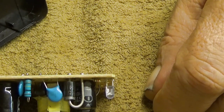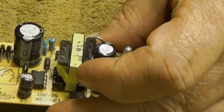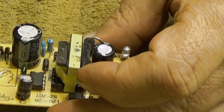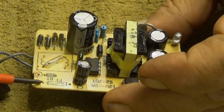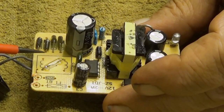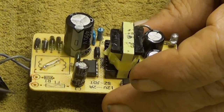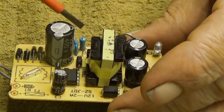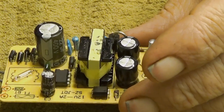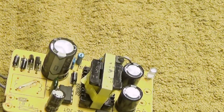That's it. So, what are we missing here? First of all, the inrush current limitation. Nothing there. Then we are missing filtering for outgoing towards the power grid. So this will feed all the disturbances into the power grid. Then we have no filtering, none whatsoever, for any radio frequencies here. It's totally void of these components.